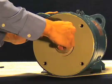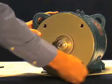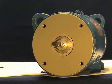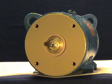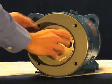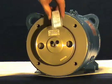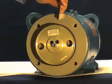Rotor installation. To start the installation, clean and remove paint and burrs from the motor shaft and mounting face. After cleaning, apply anti-seize compound to the shaft and mounting face. Do not use silicone sealants or caulk of any kind on the motor seating face, as these can cause misalignment and scraping. For this installation, we are showing installation of the universal cam screw rotor style with Avtron stub shaft. Slide the rotor onto the shaft with the cam screws facing away from the motor, and ensure the label marked "this side out" is facing away from the motor.